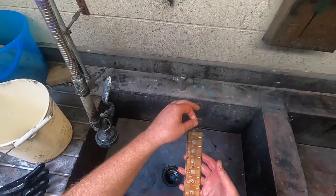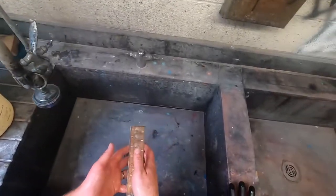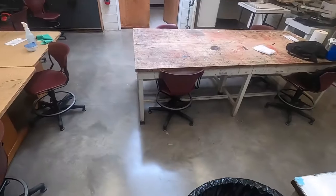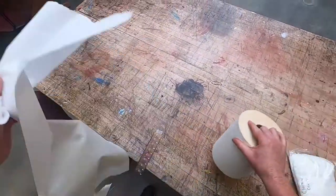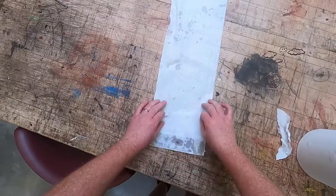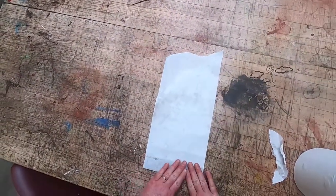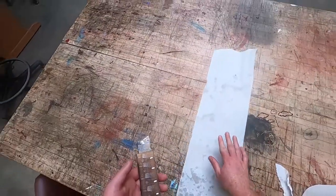Now, the packing tape is fine in the nitric acid because the nitric acid won't eat away at this plastic. So it's nice and handy to do this. I'm gonna leave those there. And at this point, I wanna come over and find some paper towels. So I have some paper towels nearby, and again, I would get used to blotting. Sometimes you can reuse the paper towels if it's not getting dirty. I'm just gonna probably try to reuse one towel for most of this today.